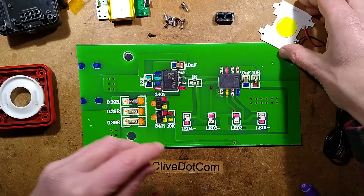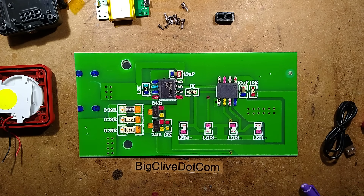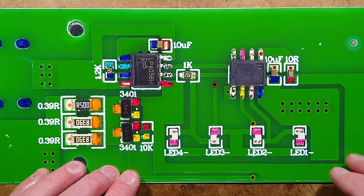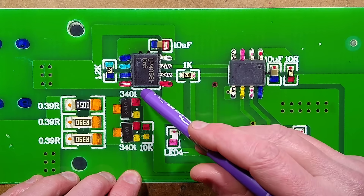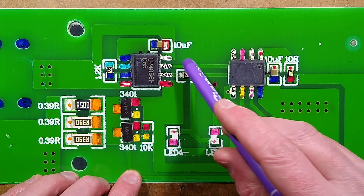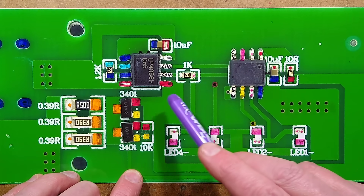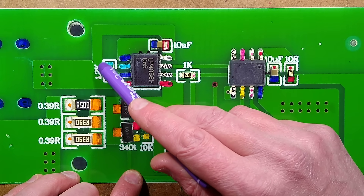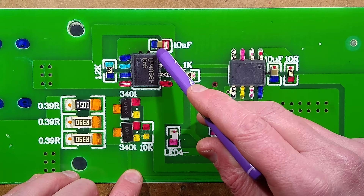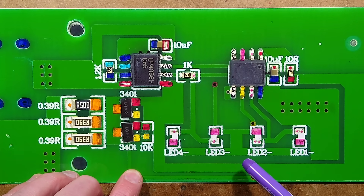The power of the COB chip can be tamed down in the circuitry if you desire. Let's zoom into the circuit board. It has an LP4056H chip, which looks like a clone of the classic TP4056, but is very non-specific about the two control pins indicating charging or standby state. There's the charge current programming resistor set to the highest charge current - about 1A at 1.2kΩ - plus a 10 microfarad capacitor for stability and a 1kΩ resistor for separation.